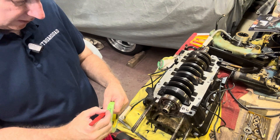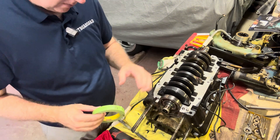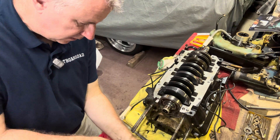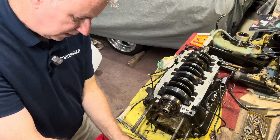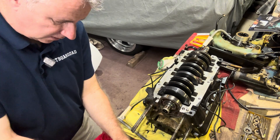As I'm labeling these and going through, I'm watching my crankshaft journals and looking at them closely. Now that we've got a couple of the bad pistons out, I want to rotate that crankshaft around to see if we still hear that knocking noise. It seems to me the knocking noise was due to the bad pistons.